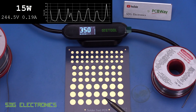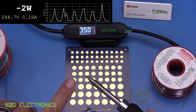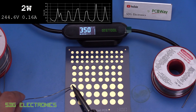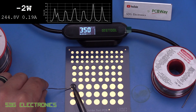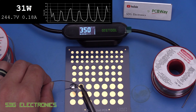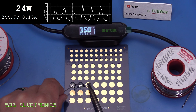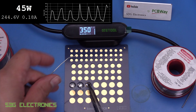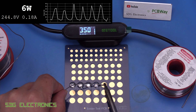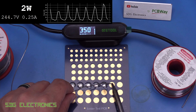Let's try a little bit of soldering on these pads here. We've probably got the wrong cartridge — this conical tip won't give us as much power as we'd like into some of these pads — but holding it at quite a shallow angle, that seems to be flowing really quite nicely. It's not making a huge difference to the power consumption on the power graph, so it's not really seeing these pads as much of a load, but the solder flows absolutely fine on these ENIG pads.